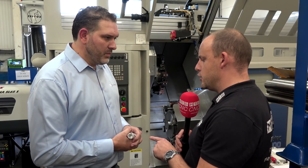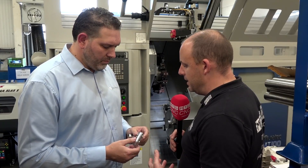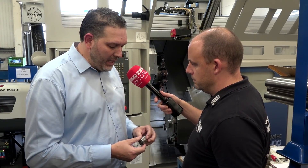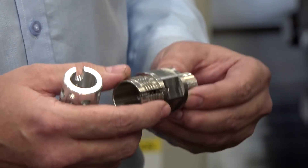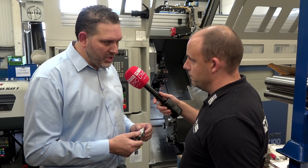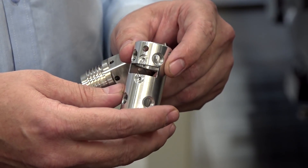Just to show our camera — these are the sorts of parts you're making here at AD Engineering. Would you describe these as classic twin turret twin spindle jobs? Yes, probably a little bit further than that, because we've got a lot of milling, drilling, threading, broaching, trochoidal tool paths. This component is for oil and gas, done in 316 stainless as well as titanium. This is an aluminium component involving servo drilling, tapping, milling, and broaching operations — multitasking.